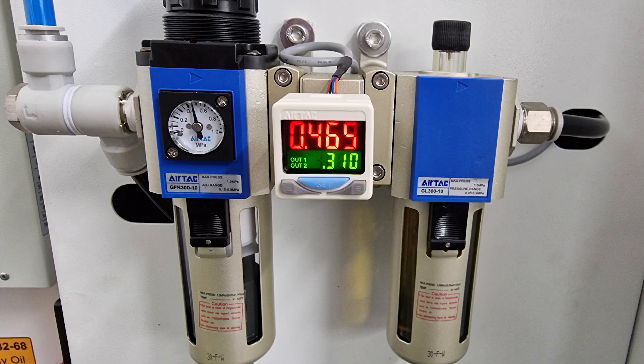In fact, the pressure supplied was high enough, so I looked into that. What was actually happening was when the tool changer consumed air, it consumed it in a large gush, and then there was a small dip in the supplied pressure that would trigger the sensor on the side of the machine, which was set to four bars. It could not have been my air tank, because that's huge with more than enough pressure. It turned out that the air hose supplying the machine has a diameter that is too small.